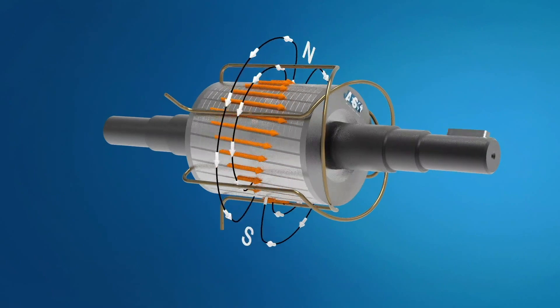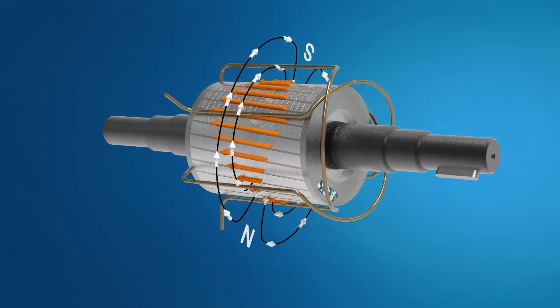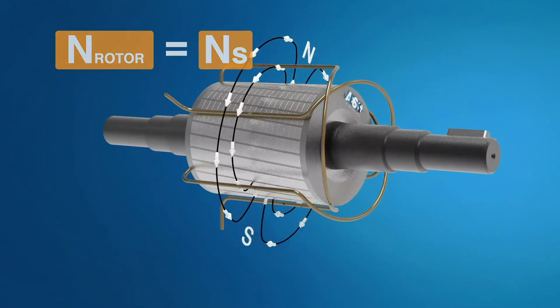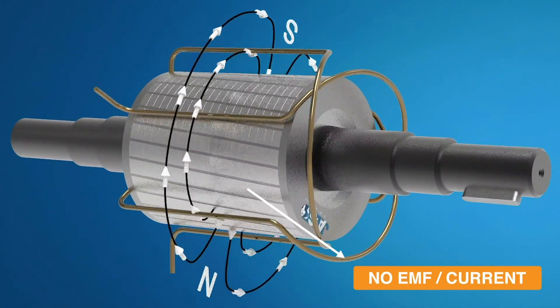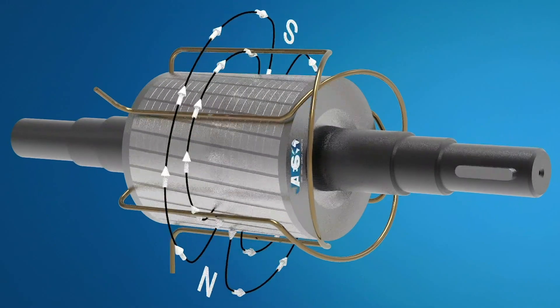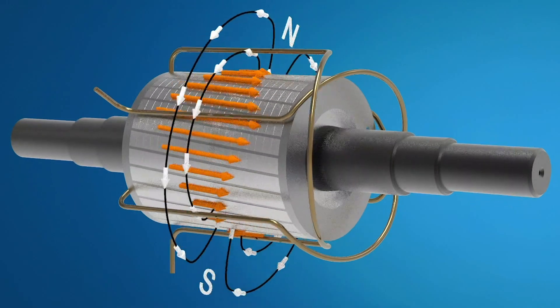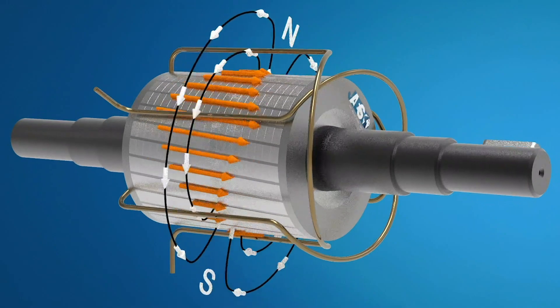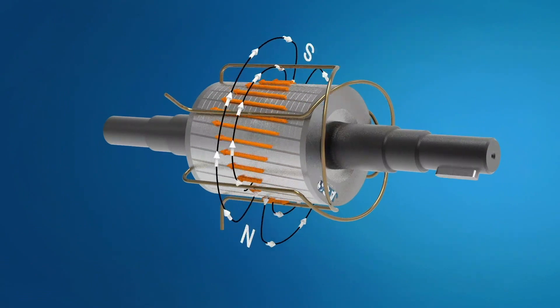As we can see in this animation, the magnetic field and the rotor are rotating. But how do we know the exact rotational speed of the rotor? Let's suppose that the rotor is rotating at the same speed as that of the electromagnetic field. The same rotational speed of both allows the magnetic field to never cross the loop, so the Lorentz force will be zero, and the torque on the rotor bar will also be zero. This will cause a gradual slowing down of the rotor. The slowing down of the rotor causes the magnetic field to cross the rotor loop, so the induced current and force will rise again, and the rotor will speed up. We can deduce that the rotor will never have the same speed as the magnetic field. The rotor will always rotate at a speed slightly less than the synchronous speed. The difference between the synchronous speed and the actual speed of the rotor is known as the slip speed.